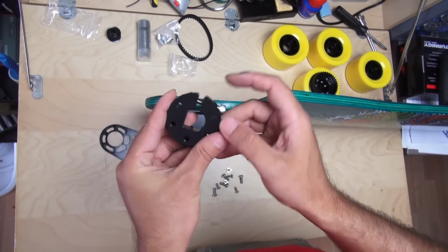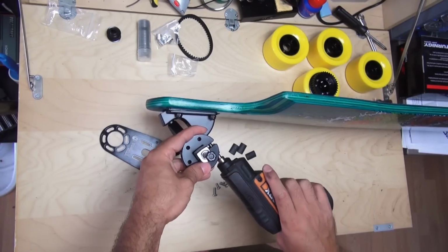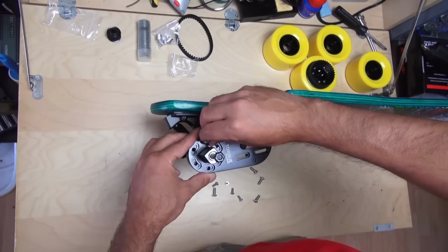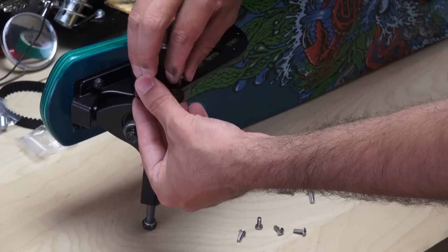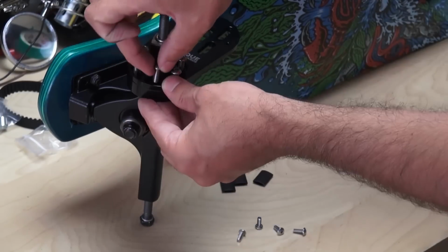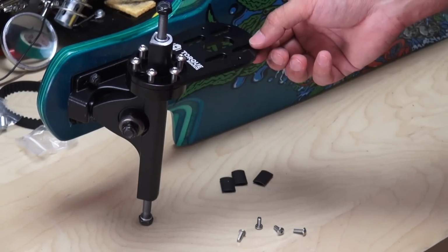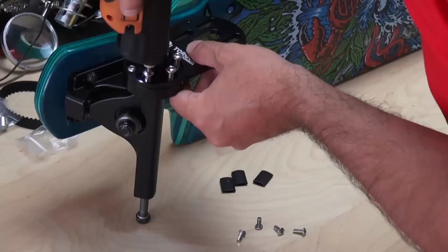As you can see, assembling the mechanical kit is straightforward. At first assembly, I would suggest not to use Loctite, because you want to find a good position for your motor. Later, when you have set up everything accordingly and you're sure about the motor position, you must apply Loctite on every screw, otherwise it will get loose with vibration on the road.